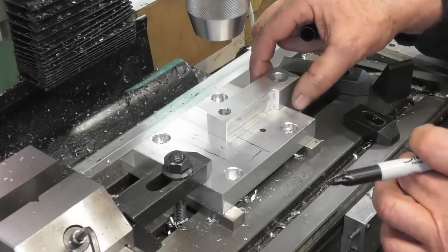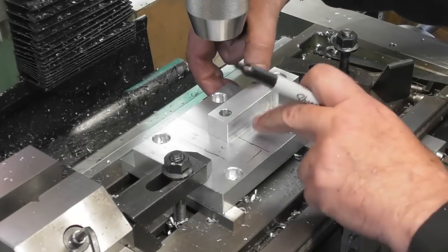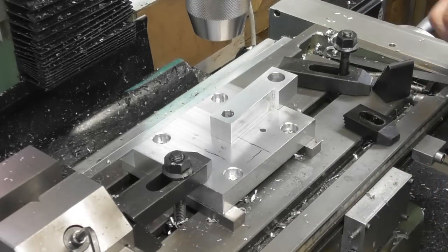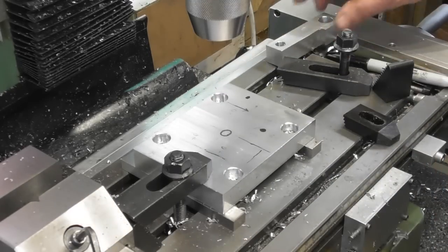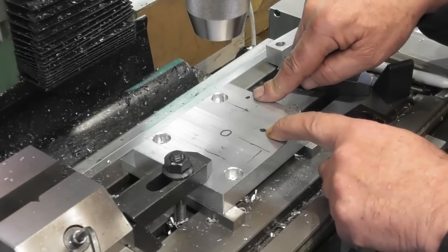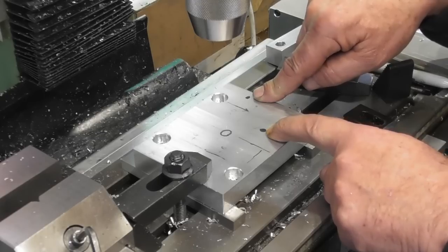I'm going to be rotating it round. And yes, that'll clamp there. Yes, that'll clamp there. And allow me to round off the end of that. So yeah, that will work for both ends. So, nothing fancy here, just straight in with a drill bit or a 6.8. I'll pick up the centre of these holes roughly.